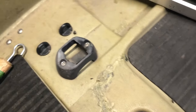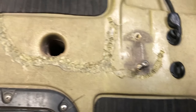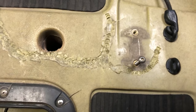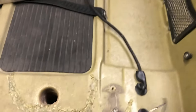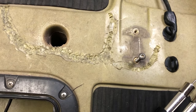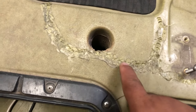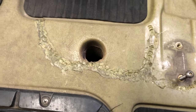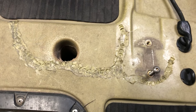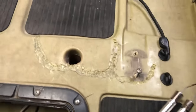There's both sides. This looks kind of bulgy here — I might turn that back down a little bit. But overall pretty happy with the results. We used this welder and only this — didn't even use filler material. So you don't even need filler material, but it would be nice to fill in some of these little spots if you have spare plastic since there's kind of a depression here. Regardless, pretty happy with it. Might have to adjust the brackets underneath just to make sure everything is level, but overall pretty happy. Good for another season.